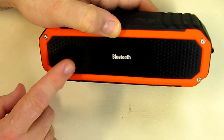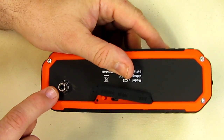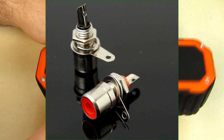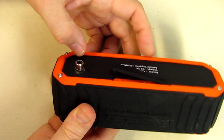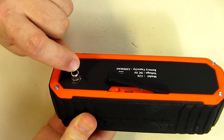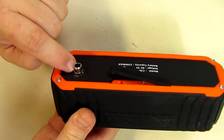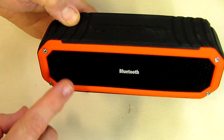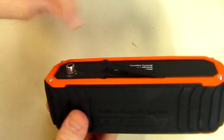There's a black wire and a red wire, and then you want to drill a hole in the back, and that's where I put that red and black wire to an RCA plug, and I glued that in after I tightened it. And that's really simple also. The red wire goes to the center of this RCA plug, and the black wire goes to the ground. And that way you have access to this left speaker. So this left speaker is no longer connected to the internal speaker, it's just the right speaker. So we're going to use this to drive the EMF coil.